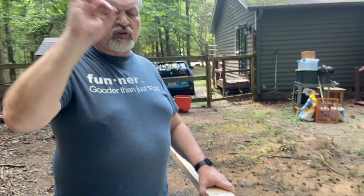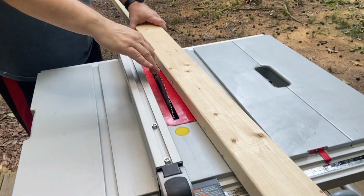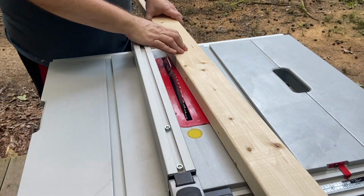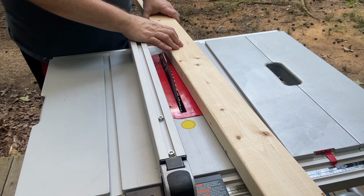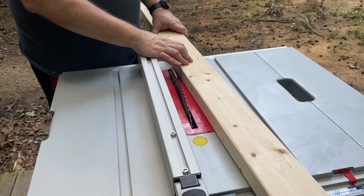Exactly. So we're going to finish the framing of the door, and we need door stops. I don't really know what they're called, right? So we need square pieces, 2 by 2 approximately. So we have a 2 by 4. We used it to calculate the width, which is really 1.5. So our 2 by 2 will be 1.5 by 1.5. Typical construction, right? So we're going to cut this. We're going to get all the pieces out of this one 2 by, and we are going to finish that process and be back with you.